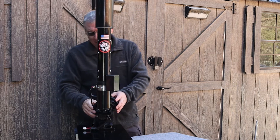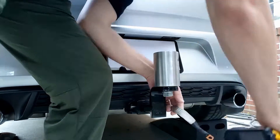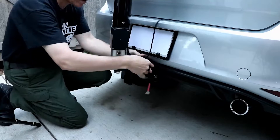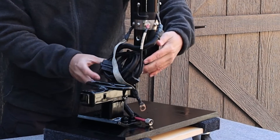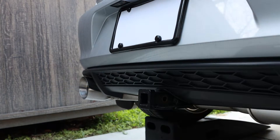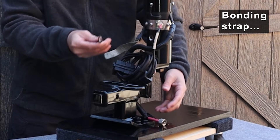Let me talk about the wiring. One of the major changes I've made — as shown in my previous video — is that I redid the mounting scheme. I got it into the trailer hitch, hooked up all the wiring, and it used to take me about five and a half minutes. Now you can see my coaxial connection and my antenna controller connection, and I have three separate choke coils in the back to keep common mode current out of the car. It is all permanently attached to my hitch mount, so now it all goes in the hitch in one fell swoop — super fast. Then I have just two connections: my ground wire goes in with the retaining bolt, and then the RF connection.